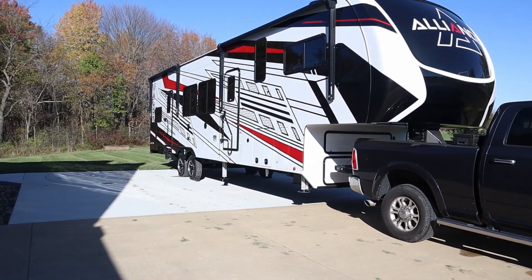If you're interested in which hitch I have with the Valor 36V11, it's the GH8056AL — that's a 4,500 pound tongue weight and 24,000 pound capacity. This trailer is rated at 16,000 pounds gross vehicle weight and has about a 2,500 pound cargo capacity. Speaking with Gen Y, they said to go with this hitch because when you put a toy or toy hauler in the back it'll affect the weight. Looking at the video of the hitch hooked up to the truck, I'm right in the green area, so it looks like we're right where it should be.